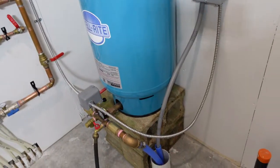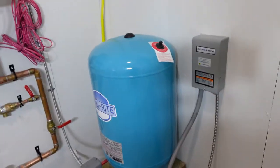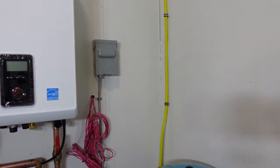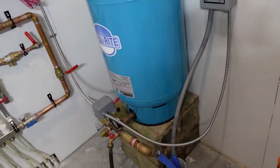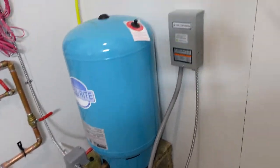Sometimes with a drilled well, jet pumps can be used, although it's not recommended. With a drilled well, you usually have a deep well pump that goes right down in the well, and that's usually a four-wire connection. So if you have that type, that's what we're going to talk about today. Here we have a standard drilled well pump system. On the wall, we have a disconnect where our 240-volt supply comes from the panel, and then we have the pressure tank, pressure switch, and the starter.